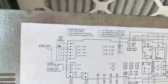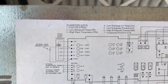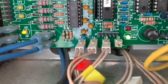If you come down to the inside panel for the Bulldog, two flashes on our LED is going to be low refrigerant temperature. Taking a quick look, I do see that we are disconnected. TR is for our refrigerant temperature sensor, so somewhere along the line this got disconnected.